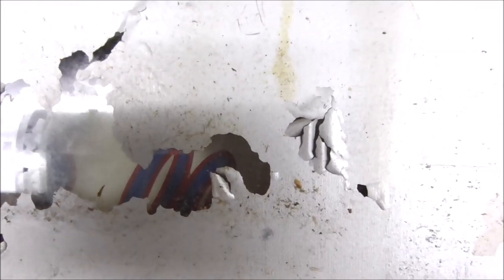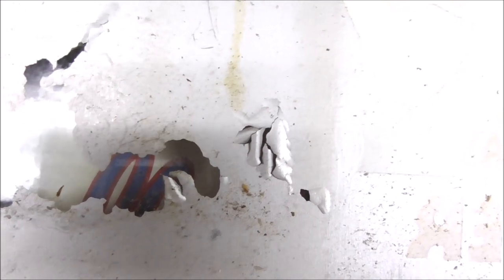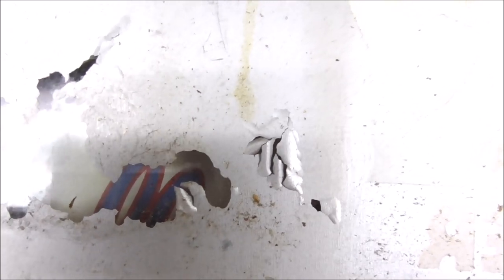And then you take a piece of Saran wrap and put on it, and then you can push down on the paint chips and push them back into place. So I've done other videos showing you how to do it, but basically you push the stuff back down flat, and then once you get the Saran wrap on it, you put something on top of the Saran wrap. The purpose of the Saran wrap is so your finger or whatever you're pushing on it with doesn't get stuck in the paint. So you spray sticky paint all over it, and then you put a piece of Saran wrap over the paint and then push down on that.